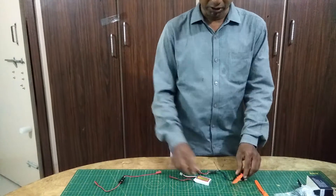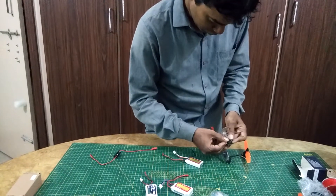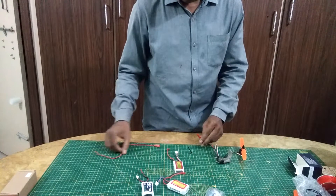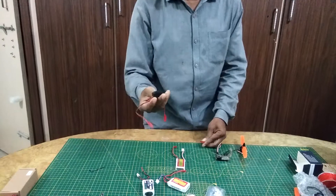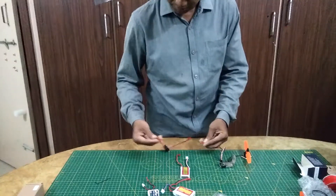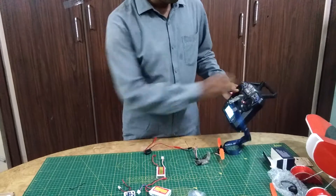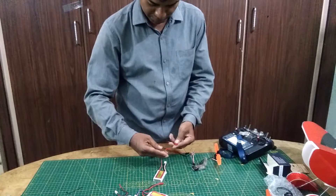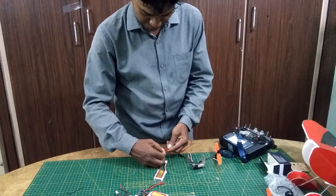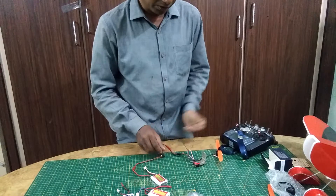I will show you how it works. This is my receiver — I will connect the receiver to channel number 3. This is our LiPo; every time connecting and disconnecting at the time of flying is difficult. So I am introducing this switch, which connects the red wire to the ESC — red to red goes here. I will switch off my transmitter. You can connect the LiPo like this. This should be switched off initially. If I connect this, now no power is coming — it is not in on mode. Now I will switch it on. Now it is on.